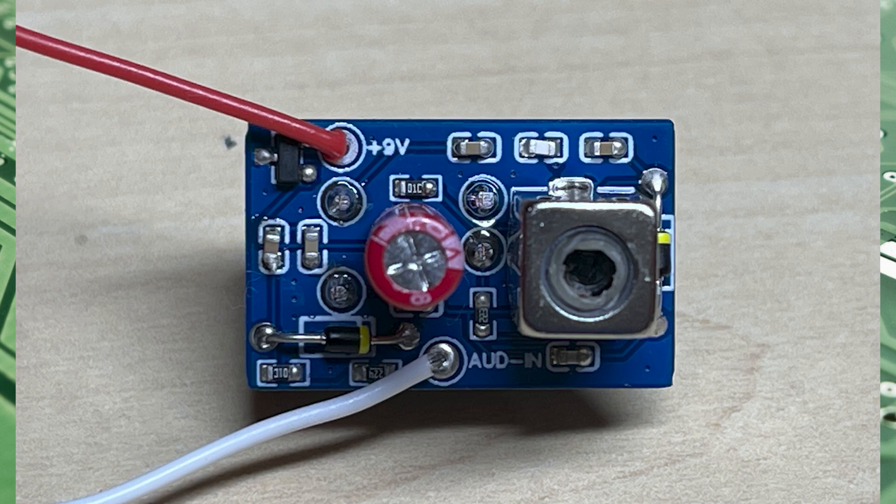It also has the voltage feed modification as well, so basically it's an all-in-one modification for your radio — a nice stable VCO voltage and the FM audio modification. The FM audio modification does require some other work: removing a cap, a coil, and changing a capacitor, but the rest of the parts are on this board and it works quite well.